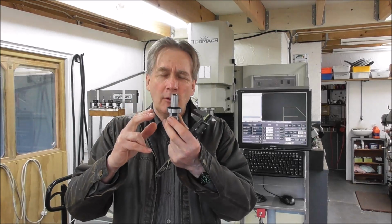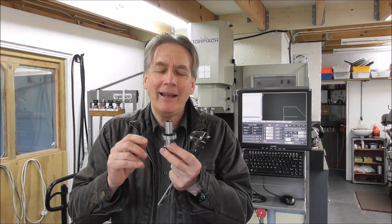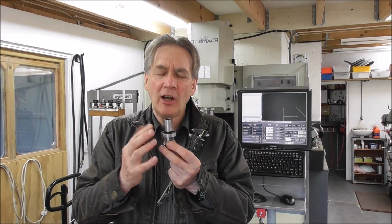And I find that with the TTS system, it needs to be spotlessly clean around the diameter and the contact flange and the bottom of the spindle nose. And when I'm doing tool changes on highly critical parts that need high accuracy, I usually wipe the bottom of the spindle nose and the flange, because I've noticed that if there's a little speck of dirt or metal on that surface, it can throw the tool slightly off, and you can trace where the error in the part is down to that. And I wonder with a tool changer whether I'm going to get as accurate a homing of the tool on its flange and diameter each time. So for both accuracy concerns and reliability concerns, I have stayed away from a tool changer.